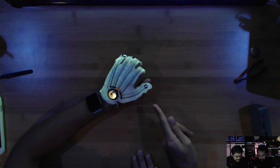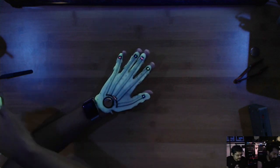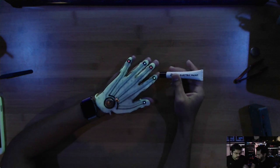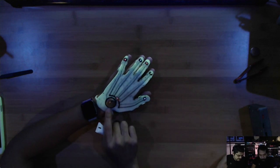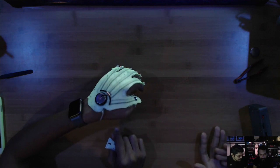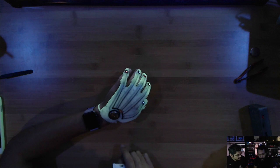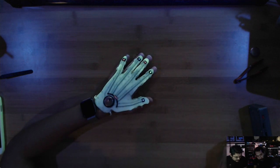Now, how did you get the actual LEDs to stick on there? Did you use something? Okay, yeah, so we can make snap fit parts on there. Oh, like the battery. So the battery snap fit, that just snaps into place. It's printed in conductive filament, and those are connected to all the traces, or at least a set of the traces, because these are in parallel. They're laid out in such a way.